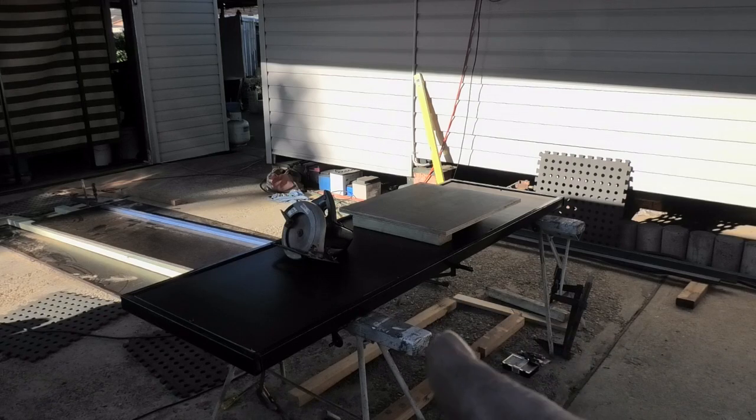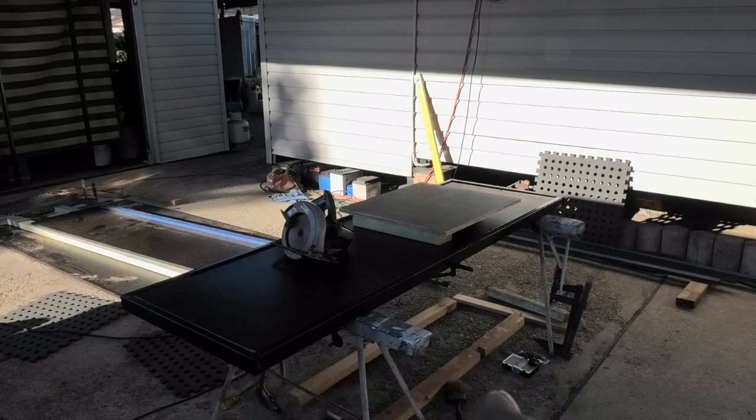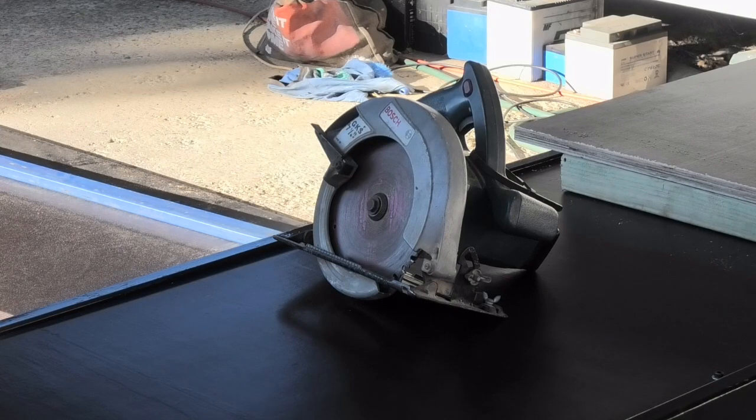That's approximately half a sheet — the sheet's 1,200 wide. I needed a 493-495mm piece to go inside this door, so that was in the middle of the sheet, no problems putting a fence up. My problem now is the piece that's the other half left over — it needs to be trimmed down about 10-15mm. It's not much.